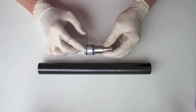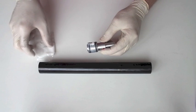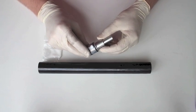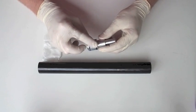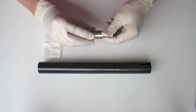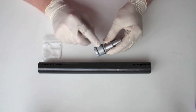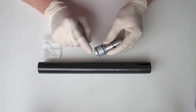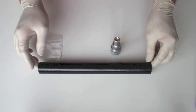Before we talk about how to get them out, I'll talk about putting them in. No matter whether you've got one of our regulators, bought a second-hand regulator off eBay or a shooting website, or purchased a DIY fit regulator, before you pop it in make sure the case and case O-rings have got a nice smear of silicone grease on. This helps put the regulator into the cylinder, makes it easier to slide in, prolongs the life of the O-rings, and makes it easier to get the regulator out at a later date.